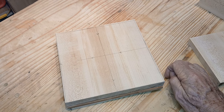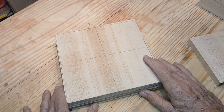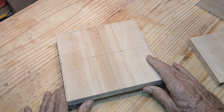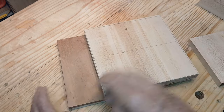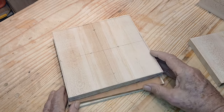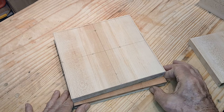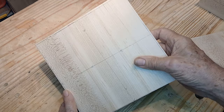Now this is going to be two bowls, but in this video it's just going to be one. We're going to use this same technique with a 3/4 inch to make another bowl similar to this — it's going to be a rounded bottom, this one's going to be a flat bottom. Like I said, I've switched the colors. She used maple and walnut; I'm using maple and mahogany. This is 3/8, this is 7/8. I didn't have any 3/8 maple, so I'm just kind of having to mix and match, but I think this blank turned out real nice.